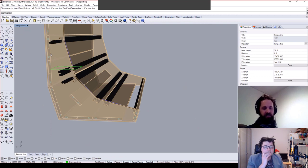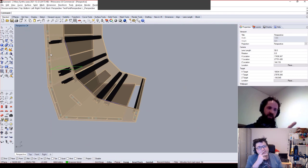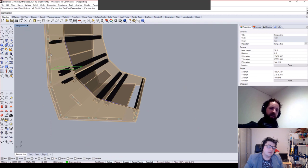But I use this laser cutter because then I can do that quickly, and it's super precise and it's always in the same place. So as soon as my drawing is finished, I look at this drawing. I don't even make the model normally. I look at the drawing and I know already how it's going to look at the end in my laser cutter. Because this is a super simple flat drawing, my laser cutter basically does that. And then I set the different colors as the depth engraving. These dowels are also engraved out, so the laser just goes back and forth, taking it out, and then I have my model. So making these dowel holes already in place would be really convenient, and then we need to find something to connect it.